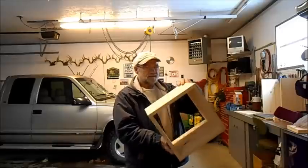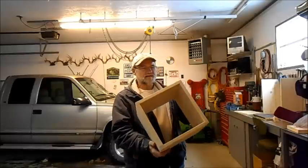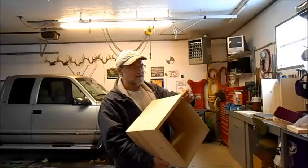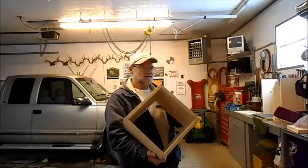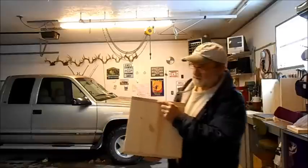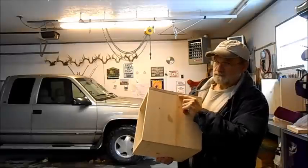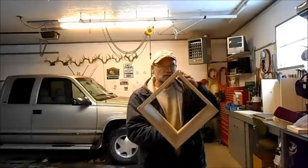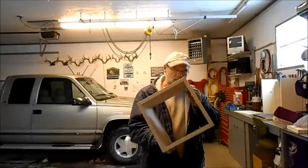A couple hours later now, I'm back. I've got the shelf portion made. I know it seems funny to have a diagonal, but it's kind of fun. This is made out of one-foot pine shelving material — it's quite inexpensive actually, but it's very well milled and very accurate. To get my one-foot square, as this is three-quarters of an inch in width, I cut these eleven and a quarter. When I put them all together, lapping them as I went around, it's exactly one foot square. Now I've got everything sanded down and I'm ready to tack-rag it, which takes the dust off.